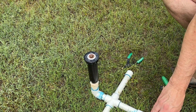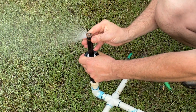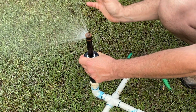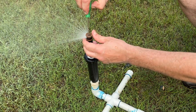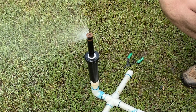Let's go back to the timer and turn it on. Now we're going to do our fine-tune adjustment, putting our limits exactly where we want on the left side by using the ratchet action and on the right side by using our collar. Then if we need to shorten the radius, we can use our Rainbird tool and run the nozzle screw down. And we're done.